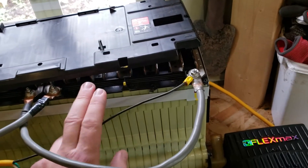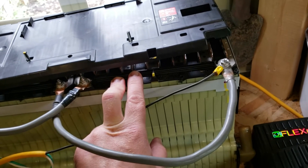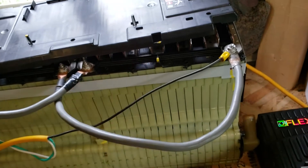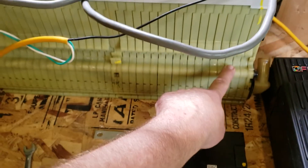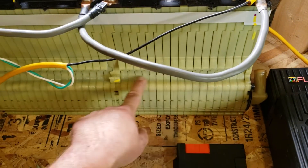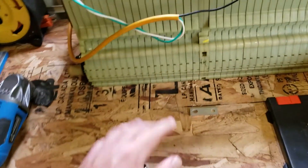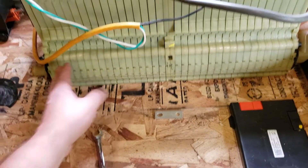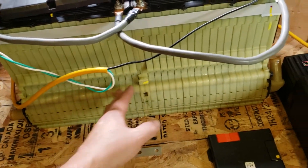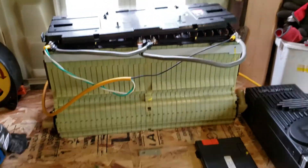This section is two different packs — two kilowatts each, so there's four kilowatts sitting here. From what I've seen and from people I've been talking to, four volts would be the maximum per cell. So I've ordered a Victron power monitor, and then I can discharge this pack to maybe 1.5 kilowatts usage out of each one — not totally discharge it so I can hopefully make these last as long as I can. I'll only use maybe three or 3.75 kilowatts out of this pack to make it last as long as possible, and that'll hopefully give good storage for a couple of years.